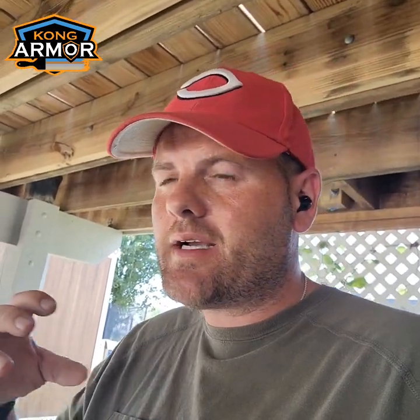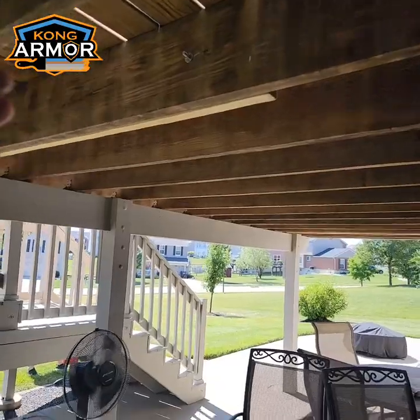All right, so all this rot in this joist, we've solidified it all up. We came in with that acetone acrylic compound that we call rot shot and applied it to all that rot, hardened it up, treated it, killed all the bacteria, mildew and corrosion, and stopped that reaction. Everything that was causing that wood to go soft and go bad, we've killed, right? And we've also just sistered them up here, right?